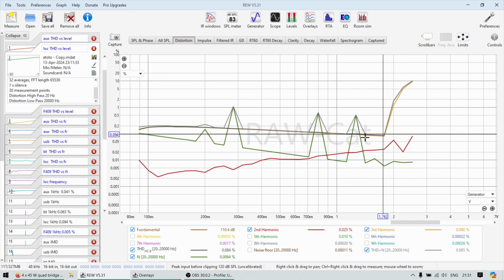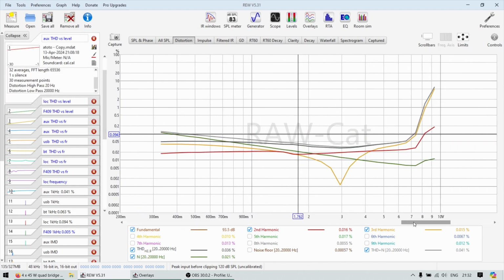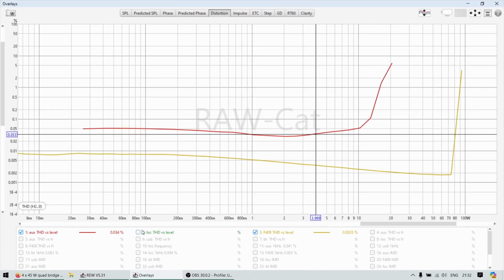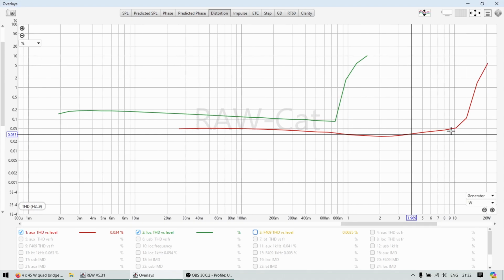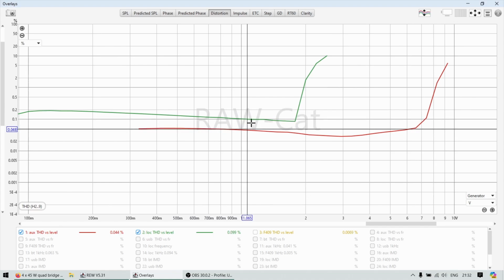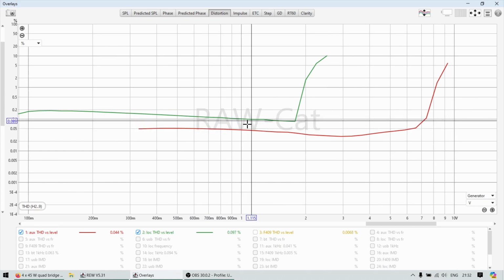So this is the line where I said for me personally differentiates bad from kinda good. These converters do reduce the sound quality, and quite a lot. Now these spikes that you can see here, just ignore them, because the level converters just don't like to be measured for some reason, probably because of the quality. But if you're planning to connect this head unit to an amplifier, please do not use these converters and just use the actual head unit out on high levels, because it is much cleaner than that. I can show you right here on this graph as well. This is the LOC. I'm going to remove this good amplifier, and just disregard the watts and volts, just look at the overall level, and you can see that the LOCs are quite a lot dirtier compared even with the high level outputs.